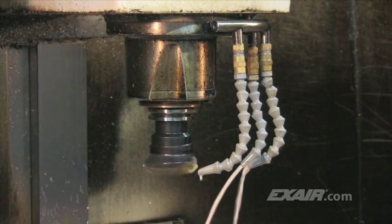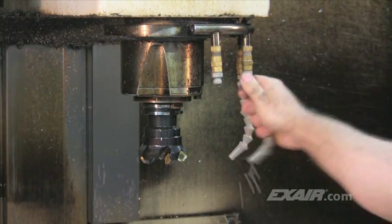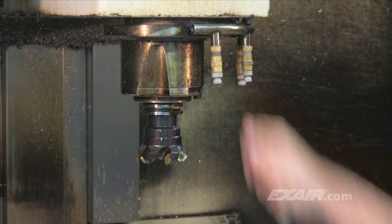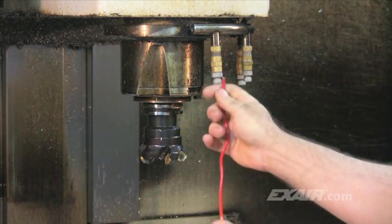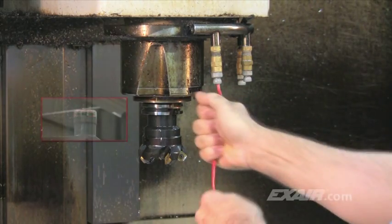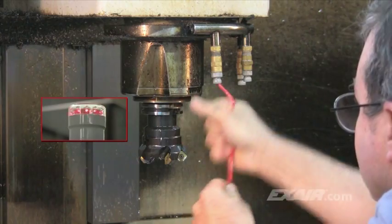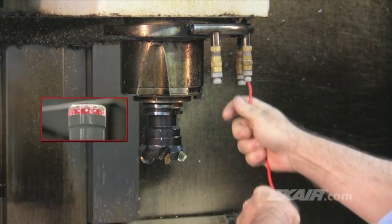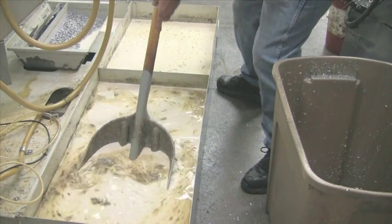If the operator of a standard machine fails to spot the lack of coolant flow, immediate damage can occur to the expensive part and the tooling. Chips accumulate in most sumps, and they end up being pumped along with the coolant into the nozzles where the chips can accumulate, and sure enough, the nozzles get clogged up. If low coolant flow happens on a machine equipped with a high-pressure coolant system, an audible alarm sounds, and the machining process stops abruptly. In any case, it happens without notice.